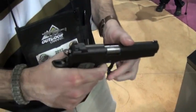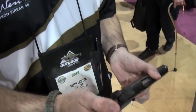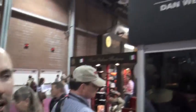We're setting up all these triggers. They should all fall. This one feels a little heavy, actually. Crisp 9 pounds. Yeah, crisp 9 pounds. Like I said, Taurus is doing it. I would guess four pounds pulled on those. 3.5 to 4.25 pounds. That's a good trigger pull. A lot of them are 3.5. Some guys want that, it's a little light. Some guys want them lighter. But we say anywhere from 3.5 to 4.25.